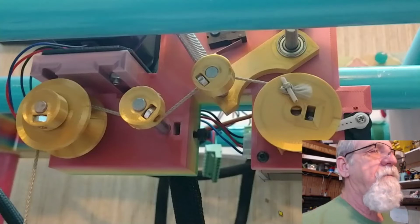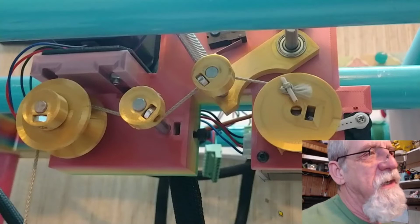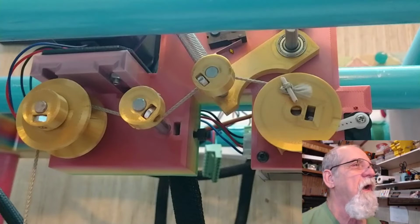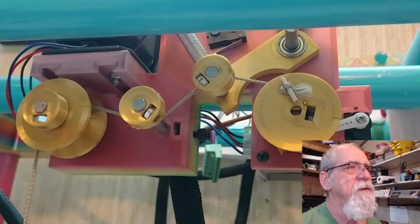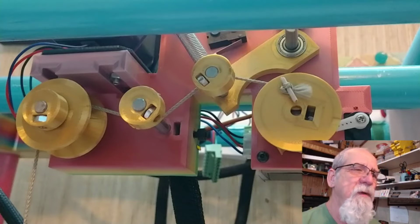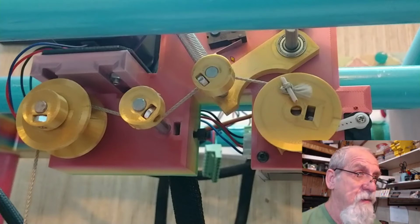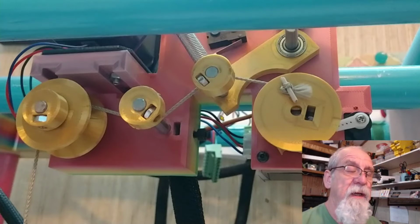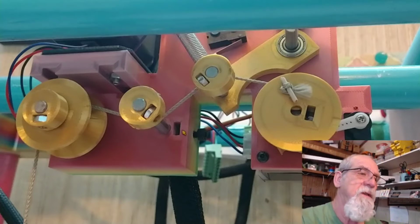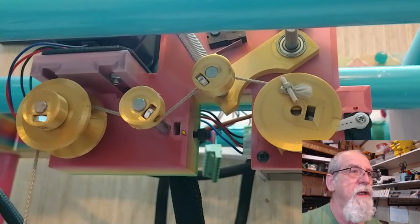Right now I'd like to show you the Carriage, the X Carriage. This is what the claw runs on. It runs on this. Up there, you can see that's the limit switch right there. And spring loaded. This arm is spring loaded. There's a stepper motor that runs on this pulley. And the claw drop, whenever they push the button on the joystick, the claw will drop. And as soon as the claw hits bottom, it relaxes this rope and hits that switch. And it activates a function, a subroutine that I wrote for the code, and I'll show you the code.